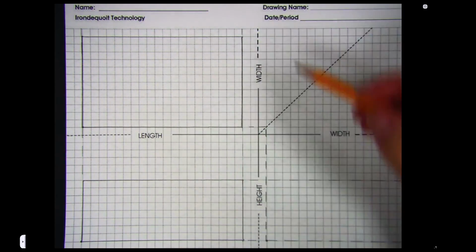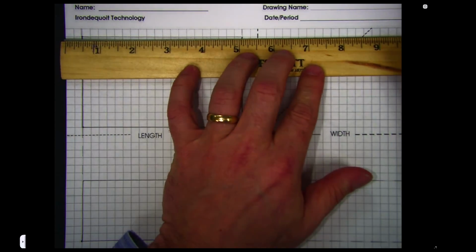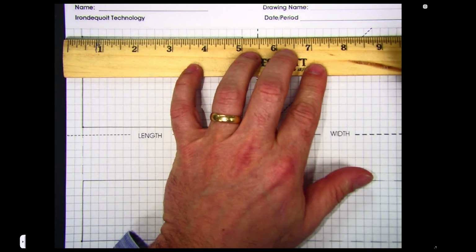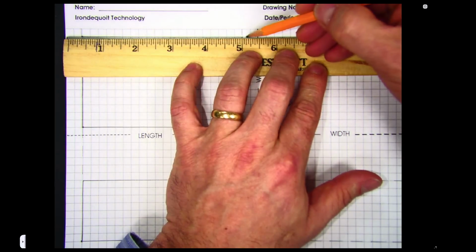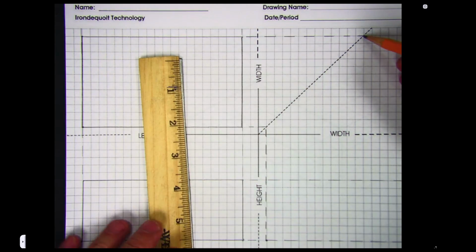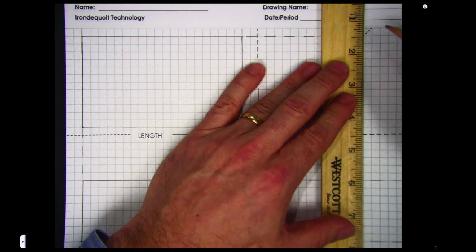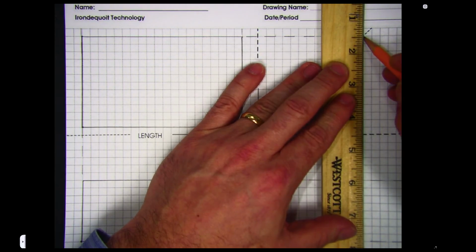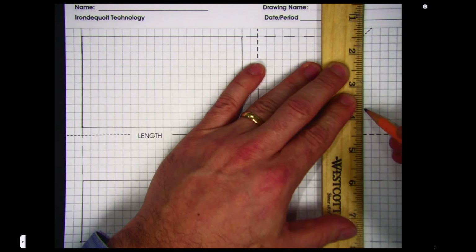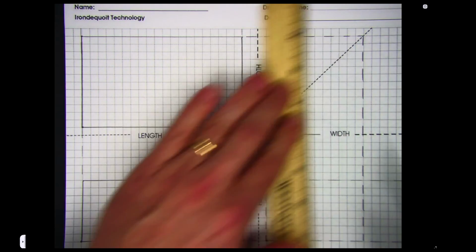I'm going to now go up to the top corner. That's another intersection point, and project over to my 45-degree rebound line and down, and it's going to go to my side view. So project it across right there. I'm going to stop, and I'm going to come straight down now, making sure I'm right on that graph paper line. So I'm following that graph paper edge straight down, perpendicular to the bottom of the page. Again, I'm making a projection line.